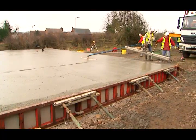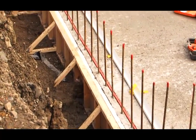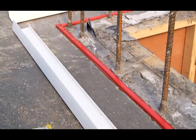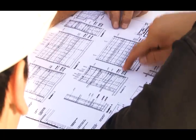Whilst there are various waterproofing methods, this particular scheme involves installing a water bar bead into a pre-made recess in the Insolslab floor finish. This reacts to the water content in the concrete mix and expands to create an upstand to resist water ingress at the junction between the floor and basement walls.